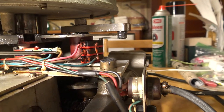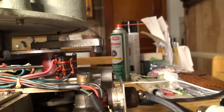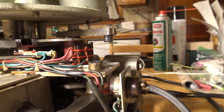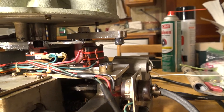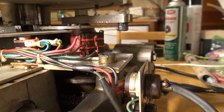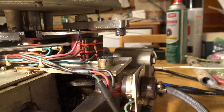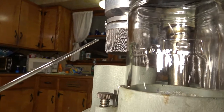If you look on this shaft there is a cam with notches cut in it. As the machine runs, those switches will turn on and off respectively so that it will run the mechanical operations of the cleaning machine. The first top switch right here — that little bugger — controls the basket motor operation. It turns on and off the motor that runs the basket, which is where your watch parts are going to be.